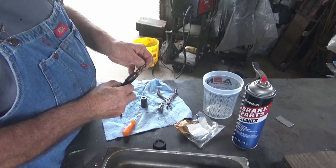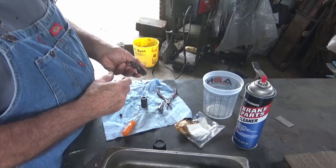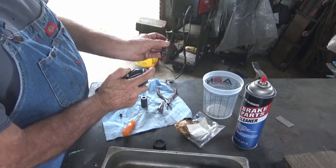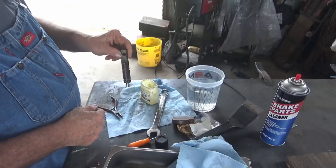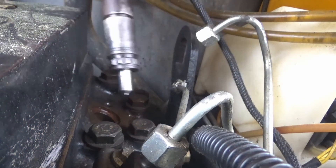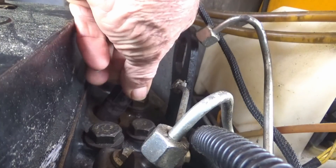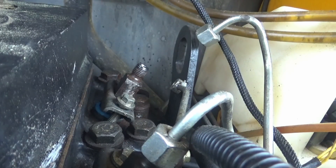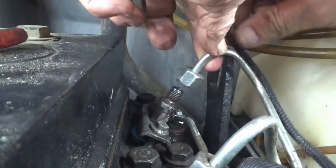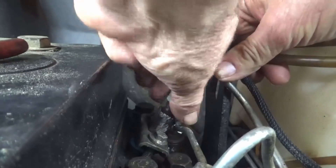There's the spring — see, that's a real tough spring that the needle has to push against. Make sure that's unplugged. So this should be ready to go back in right there, no problem. In goes the injector — got the crush washer on it. High pressure line going on.